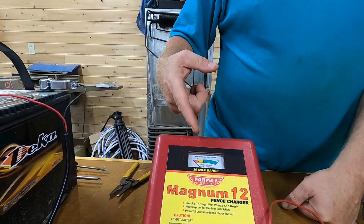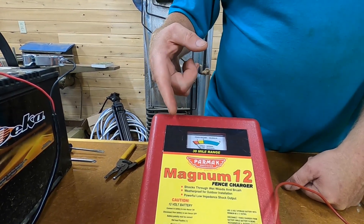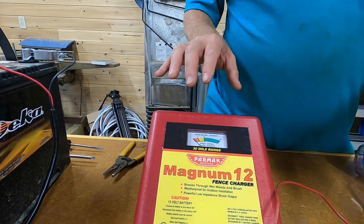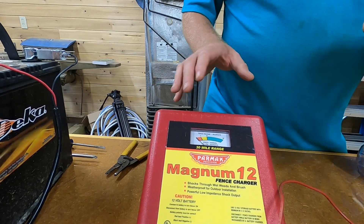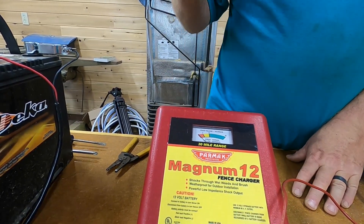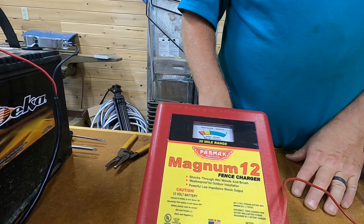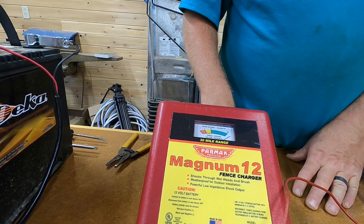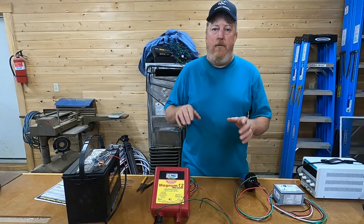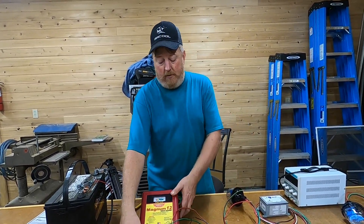So now it's ticking the fence. It is holding it down at the moment — but there you go, it popped up to 10,000 volts. So this is kind of what I would expect, because the gap in there is such that about 8,000 volts should conduct across. You'll notice that every now and then it dumps across, and other times it holds it back. I know this is very unscientific, but what I'm trying to show you is that this is allowing 10,000 volts through quite often.